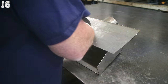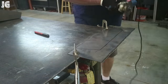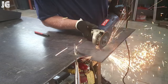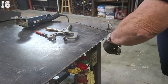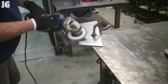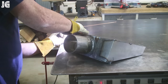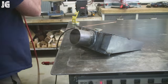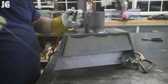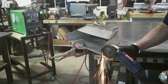This is just the top piece I wanted to add — I wanted to create kind of a tunnel, so when the dust collection vacuum is going and you sweep the sawdust in there, it just sucks right up. I created a little protective hood over the top of it. All this stuff I do on the fly — just thinking in my head as I go. Once I got that all cut out, I took the flap disc and softened up the edges a little bit. Much to my surprise, I thought I'd have to do a lot of trimming, but that thing fit on there perfectly the first time. I got it all tacked up and was able to fuse a couple of the sides together. Across the very top on the back there was a little bigger gap than I was hoping for, but a little filler rod got everything welded out pretty good.